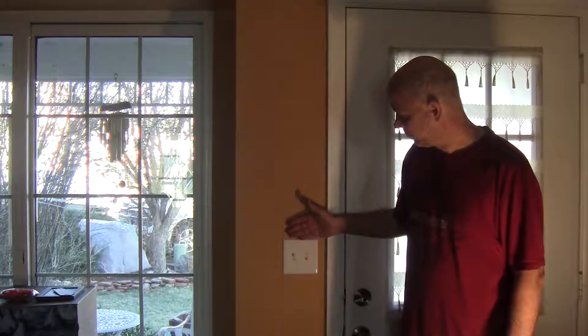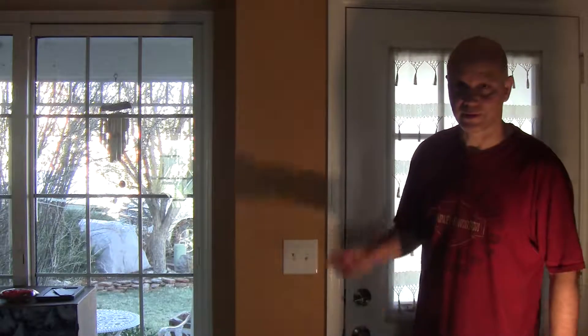The problem with turning the circuit breaker off is now there's no light in the house, so I have a little temporary light bulb set up. This is the light switch I'm going to be changing. I'll bring you in and we'll look inside and make sure there's a neutral in there. You might find that a lot of light switches won't have a neutral because they're really just breaking the hot wire going to the light, and the neutral might run somewhere else. Let's get in there and see — cross my fingers.